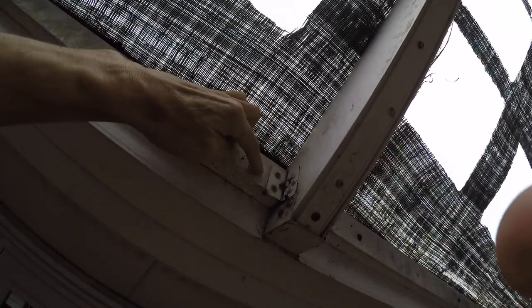Okay, so this sort of ends here. This is the highest point, 6x6. So I sort of end it right here and go over and continue this as rafter number 5. It's reinforced with wood, 2x4. Then it comes down and it is attached to the super gutter the usual way. I just reinforce it with a couple more aluminum angles. Okay? So these screws go all the way through the 2x1 and go into the super gutter.